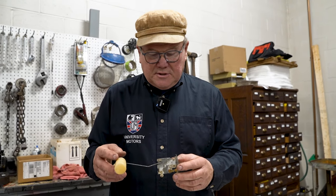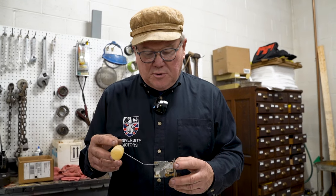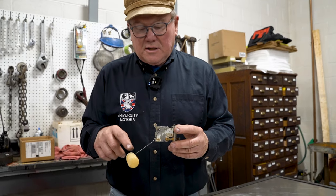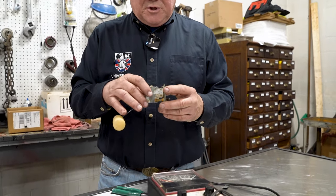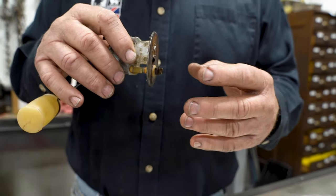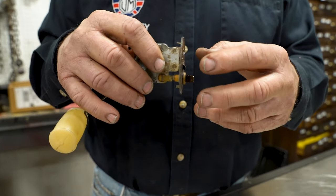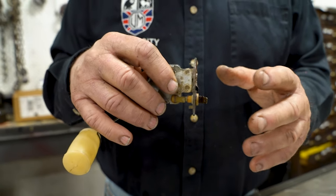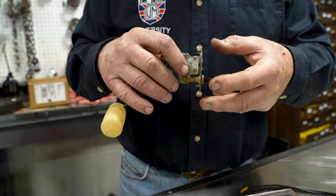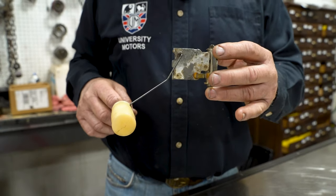Most often, quite frankly, you can repair these even if they're jammed up. If your old float is sunk, you can buy a new float. When you go to put this back together, there's a rubber seal that goes on the back side when you put it into the tank — it's an ERA 1501 and an ERA 1502 on the outside. I use grease on everything. Get it all in place and tighten up that ring on there really snugly and it'll work just like new.